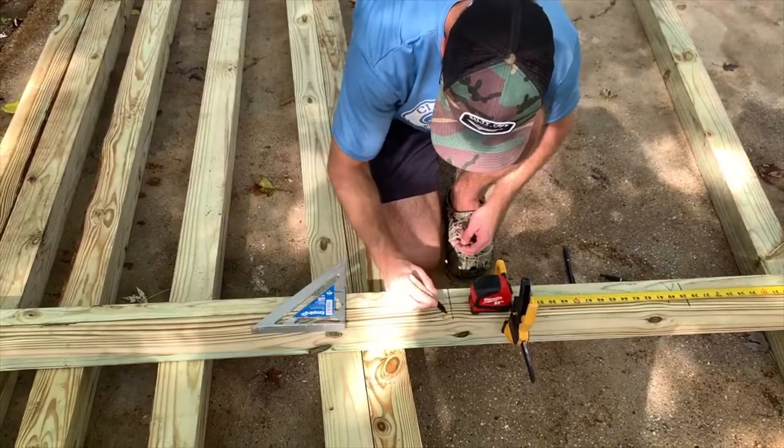Now, after doing the front fascia board, let's move on and install the 12-foot fascia board on the back of the shed. Just like the front of the shed, we're gonna install that temporary support brace on the outermost roof rafter, and then we're gonna lift the 12-foot fascia board into place. We're crowning the board right there to make sure that it's crown up. And again, pay attention to crown for all of the shed installation. You wanna make sure that everything is crown up on the roof. That goes for all the roof rafters.